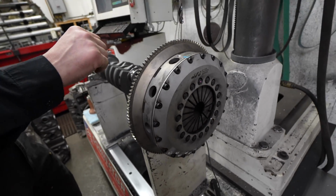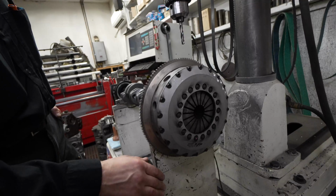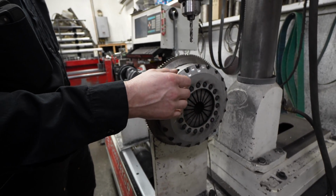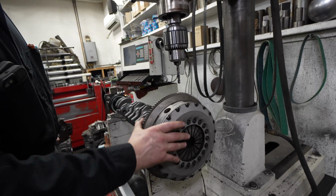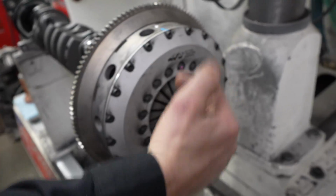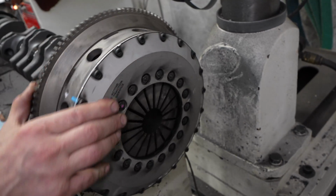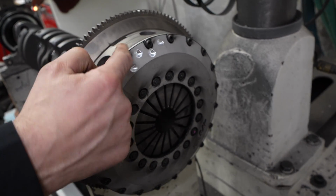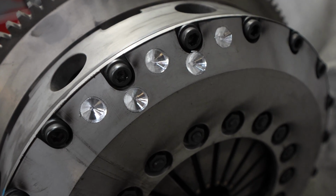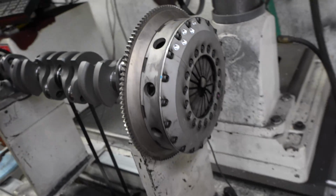You know, that was about 4 grams, but then the plate on it, there's actually movement in it. So whenever I do this, I put marks up here. When you install it, this needs to be at the top because the weight of this drops, and it'll change the balance, which made it to where on the bottom side, we took all that out. So it's like, how do you make a system to where once you know it's balanced, it's spot on.